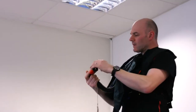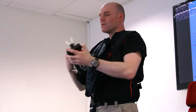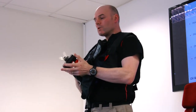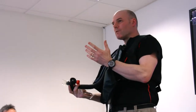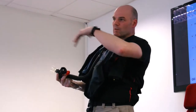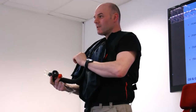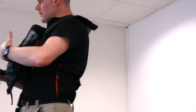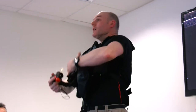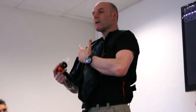If you want the technicalities: the one big breath that you put into the bag — they say theoretically, regardless of age or physique, you should get at least 30 seconds worth of air to re-breathe in a shallow ditching just beneath the surface. The gas charge in there is just compressed air — 79% nitrogen, 21% oxygen, just similar to what we breathe naturally. That should give you a minimum of around 45 seconds. So in theory, it says one minute and 15 seconds total. You're not going to spend one minute and 15 seconds under there. The idea is to give you a tidal volume so that when you gasp with the cold water, you have a volume that will prevent you from suddenly having a restriction of air and panicking.